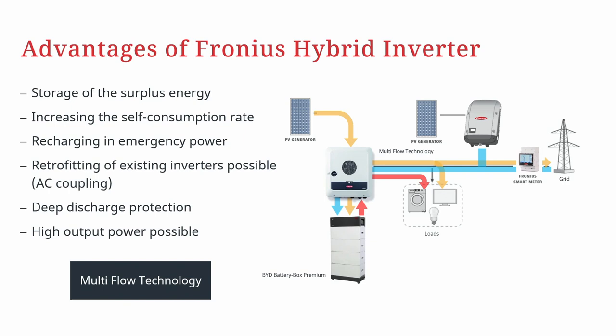When installing into an existing system where you may not have enough space on the roof for a PV generator, you can install such a system even without a PV generator on the Gen24 Plus device. However, especially when using full backup power, please note that it is vital to install a PV generator on the Gen24 Plus device. During grid blackouts, having PV modules connected allows you to recharge your battery even when the grid is down.